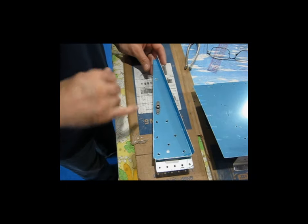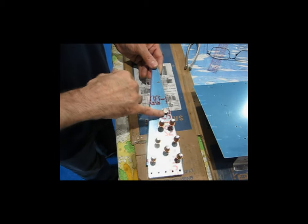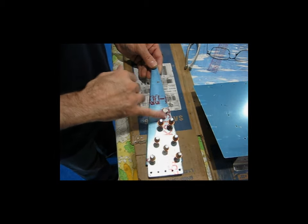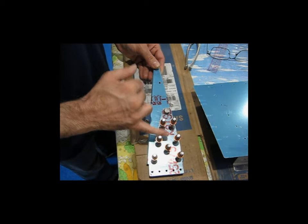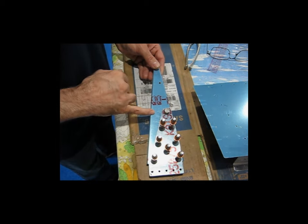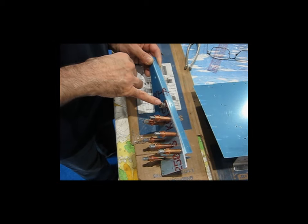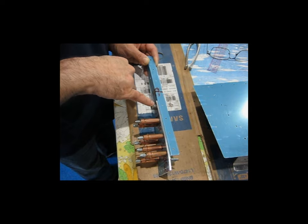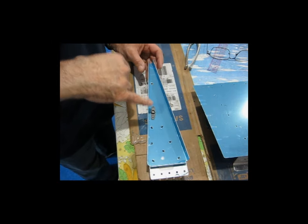So you've got to have the nut plate positioned. You've already got the hole drilled in both of these plates. So I just went ahead and re-clecoed this plate to this rib, and using a short quarter 28 bolt with some washers, I was able to grab the nut plate and tighten it.